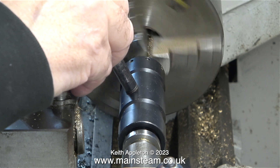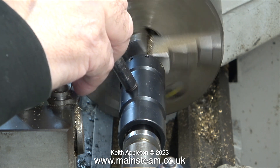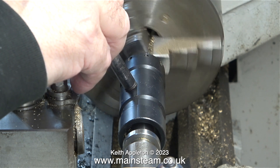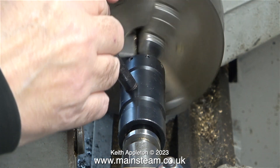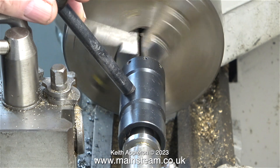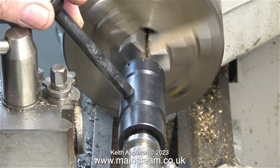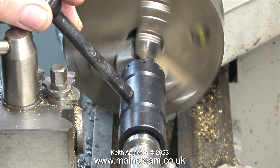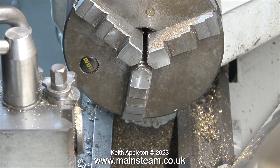I want to show you something important here. I'm threading under power — the lathe is in back gear and it's very powerful. I always use the open part of my hand on the handle of the die holder, depending on which way the work is rotating. By doing this, if the die holder should grab, the handle will be pulled out of my hands causing no injury whatsoever. As I reverse the direction of the work, I use my other hand, and if the die holder grabs it pulls the handle out of my fingers. A bit of health and safety thinking can save a lot of problems.